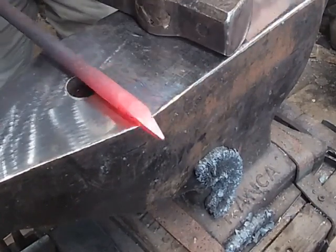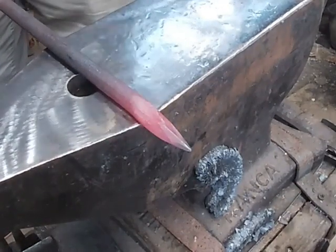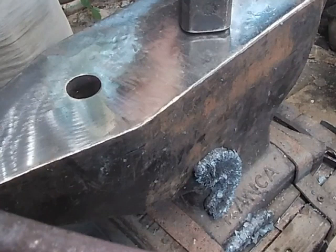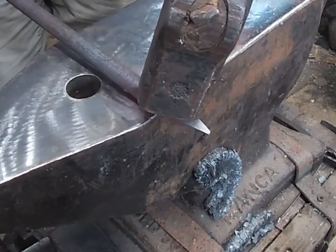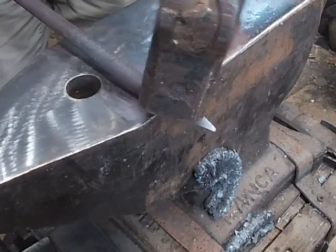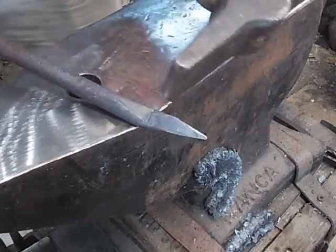Now I'm going to go where your bump is right here and turn it all the way over. I'm going to go over the edge of the anvil, hammer straight down. You want to get that lip and that shoulder put in. When you come out of the fire, you're going to hook-roll slightly to one side — half on, half off blows — same way as when we're making where the nail goes. Half on the anvil, half off the anvil, and you're driving the material down to make that shoulder.